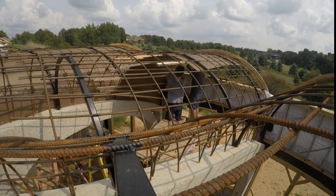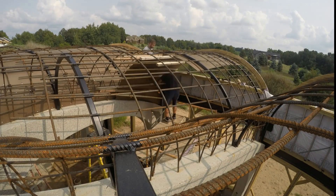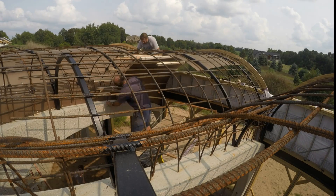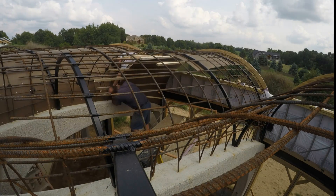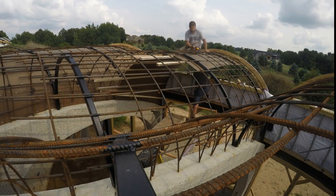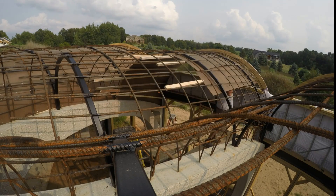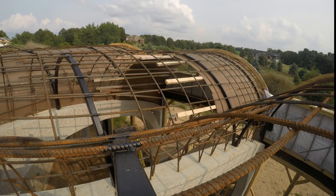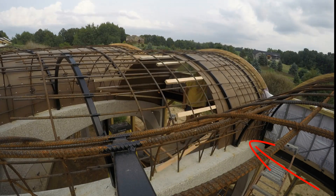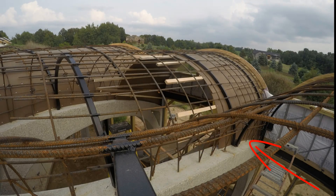This footage shows the process of adding the battens to the overlap. It takes one person inside to hold the battens and one outside to drive in the screws. Another thing to notice here is that I started bringing up the hardboard panels with that middle batten already attached. The panels were all the same across most of the vault, except for the edge touching down against the concrete arch — those needed to be custom trimmed to fit and always took much longer.